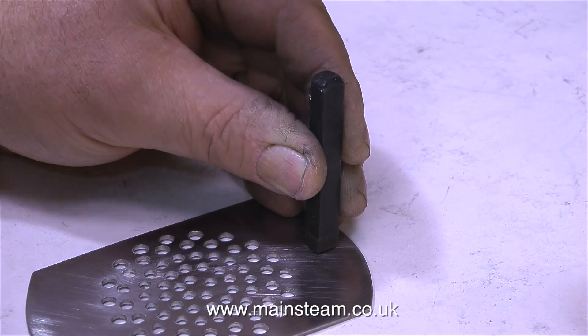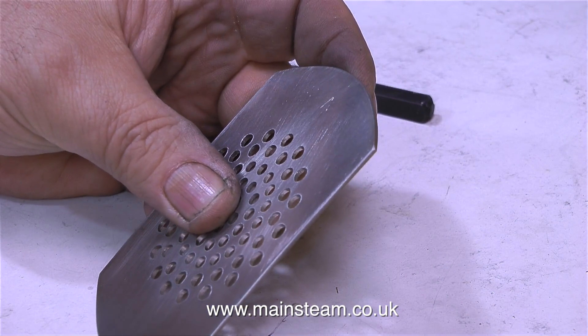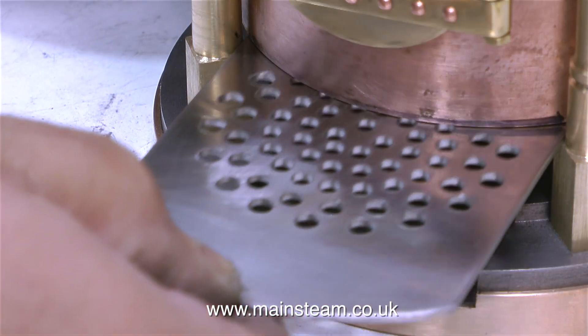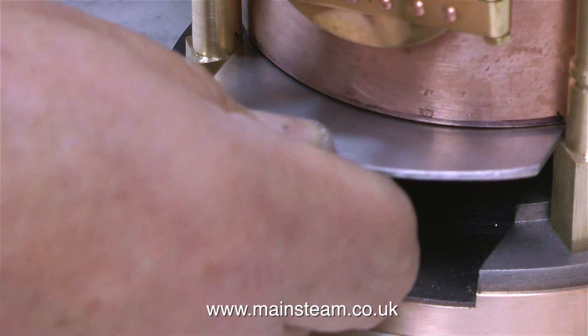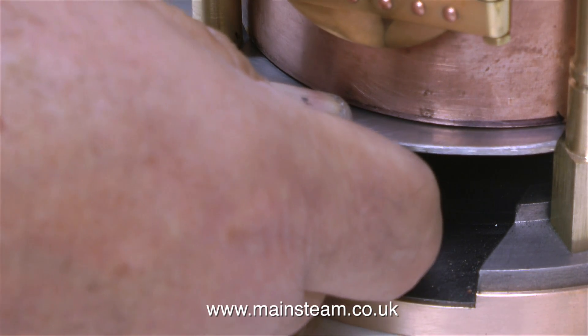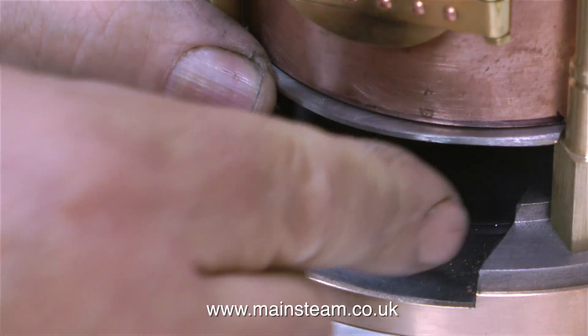In this clip, you may be wondering what I'm doing. I'm just using a letter punch — it's a letter V — as an arrow, to show which way this fits in, because it's slightly tighter at the back to stop it from going all the way through. Now that the boiler is nearing completion, I think the next job is to connect up the water pump and give it a test steaming. But that will have to be on another day because the weather's not so good today. Thanks for watching, and I hope you found it useful.